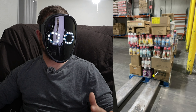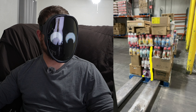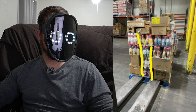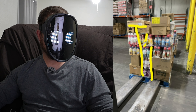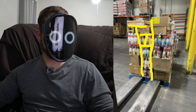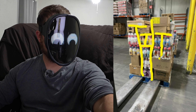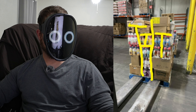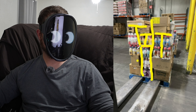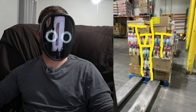My main issue is he's not cross-tying anything. I'm going to draw some lines so you can see how this pallet is stacked, because it's hard to really see it at first. You've got it going like this, with a cross-tie here and a cross-tie here, but this section pretty much goes straight. So all this has nothing holding it here, there's nothing holding this corner, this middle is just sitting there rocking — this is going to fall.